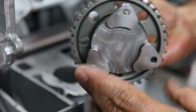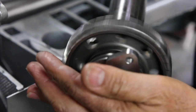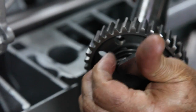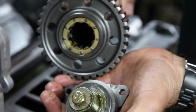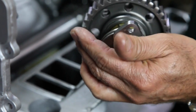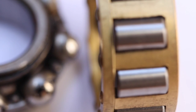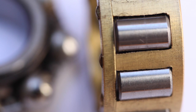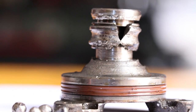The IMS in this particular case is a cylindrical roller bearing IMS, which has five times the radial load capability than a conventional ball bearing or hardened ball bearing. Cylindrical roller bearings are designed to withstand extreme loads and not fail under extreme loads.